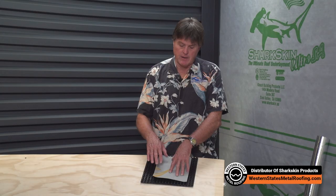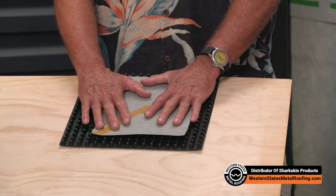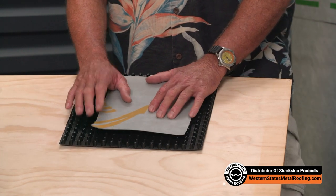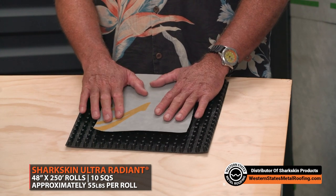This is similar to a tech shield or a polar shield where you've got a piece of OSB that's got a foil layer on the back of it. What we're doing for existing houses that don't have tech shield or a radiant barrier built into the roof system, we're providing an option in a re-roof application or even new construction where they want a radiant barrier product incorporated. You put the Sharkskin Ventilator Roof Mat down with the pedestals up, creating a half-inch air gap, then install the Sharkskin Ultra Radiant over the top of that.